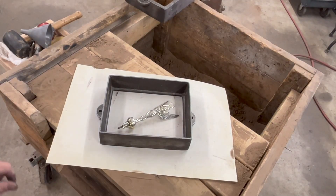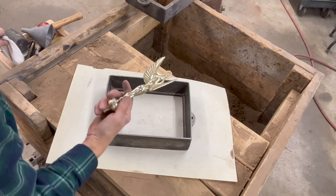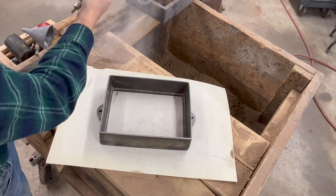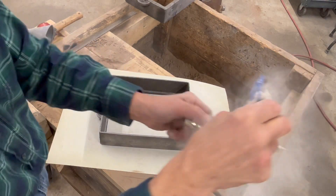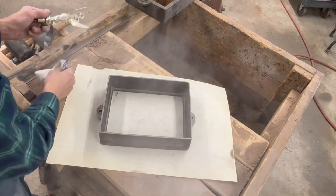Welcome back — Crafty B, maker of things — back to sand casting. I have this vintage trophy topper, a winged goddess, and I want to reproduce her in aluminum. This one is zinc, but it doesn't really matter what it's made of. First thing you have to ask yourself: will this come out of the sand? We need to cover it with foundry powder — talcum powder, release agent — so the sand won't stick to the pattern.